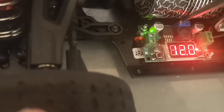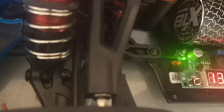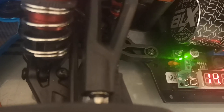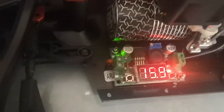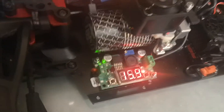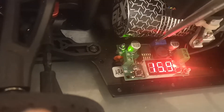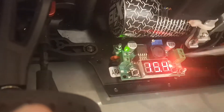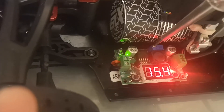It's pretty handy - if need be, it can be adjusted. At 12V these things will do pretty much 20CFM. At 16V I'll take a 4S part and if I want to go direct, it's going to go through here. I want to test it at full volts. The complete fan and voltage regulator draws under half an amp.